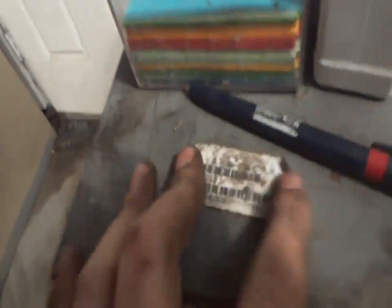But if you're going to put this on a tractor, I would not suggest putting it on a hydro gear transmission. The way I can check to see if yours is a hydro gear transmission is, either A, you can look underneath your tractor, right underneath here, and it'll say it on the back. See right where that little white tag is? It'll either say it on that, or if you lift up your seat and find a little tag that says something like this over here, hydro gear, I wouldn't suggest putting it on.